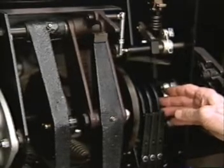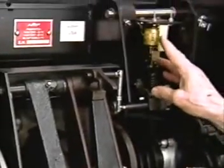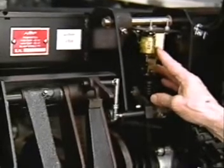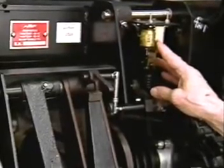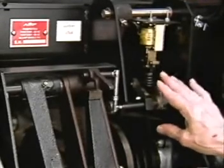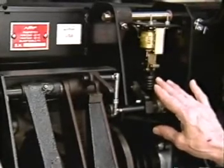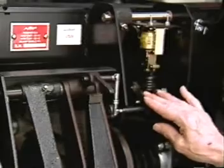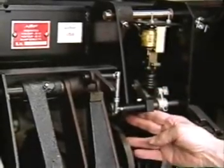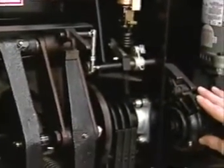Spotting or respotting is taken care of by this solenoid that we find here. When this solenoid is energized, the machine will perform a spotting cycle. When this solenoid is de-energized, the machine performs a respotting cycle. This solenoid then will do everything that needs to happen in order to make the machine spot pins. That is, turning the cups from horizontal to the vertical, removing the shuttle stop so pins are put into the cups, and here unlocking the table drive assembly.